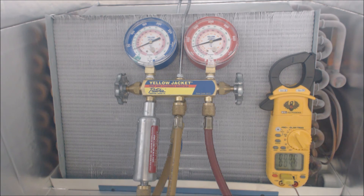It's just going to keep freezing more and more until it's a solid block of ice. If you run into this in the field and it is a solid block of ice, you need to let that melt before turning the fan on — if you try to turn the fan on with a solid block of ice you're going to ruin the blower motor. If it's only partially frozen, go ahead and turn on the blower motor because it'll help defrost the evaporator coil. You're going to have some melting and water falling through the unit, so be aware — the condensate pan can't catch it all. Let it defrost as naturally as possible, then go ahead and check the refrigerant charge. You can't adjust the refrigerant charge or do anything until that evaporator coil is unfrozen.